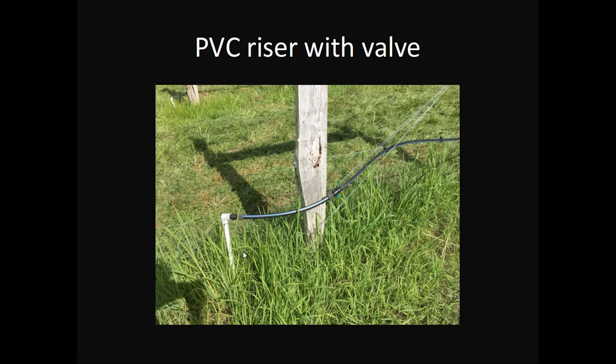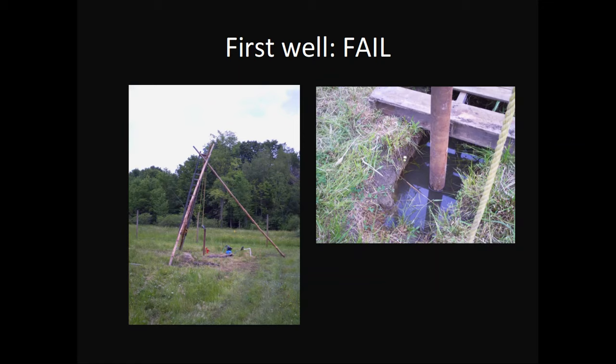The real big problem was I just didn't have enough water. I was spending too much time running back and forth for water — I needed a reliable water supply. A neighbor helped me and we tried to put in what's called a sand point to get water from our water table. Our water table is kind of weird. We have a shallow layer that's saturated with water, but I'd call it high mud. Below that we go into brown clay, gray clay, and shale. Once you break through the shale you hit a bonafide aquifer. We got that point down 25 feet and it stopped — it refused to go any further. The hole's full of water. That's my high mud. We couldn't get it down any deeper. It was not going to work.